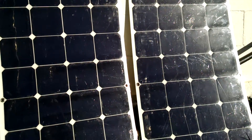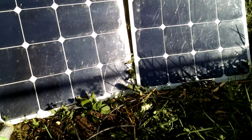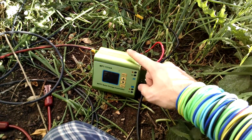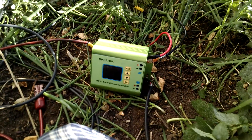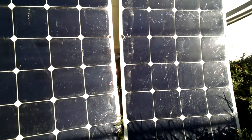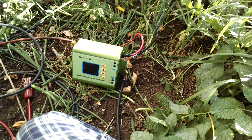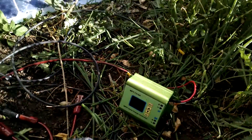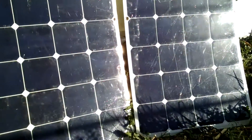I hope anyone that was having the same troubles I was having, or similar — I hope this helped you out. My next stage for this project: I think since I now have two of these — because the company sent me a replacement even though I didn't need it apparently — I have two of those and two panels. I think I might try wiring the two panels each to their own charge controller, and then that to the battery pack. That way it balances things out a little more between the panels.